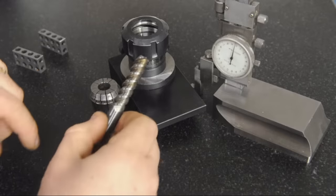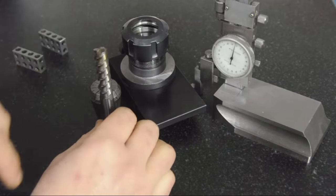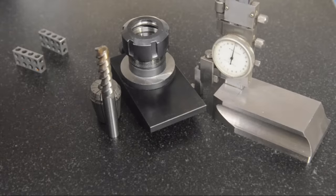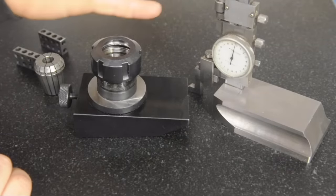Getting the end mill properly oriented with respect to the fixture, I've always found to be really the trickiest part. Not really tricky, I mean it's not difficult, but I found that if I get this right, then the grinding seems to go a lot better. The fixture goes in the grinder along sort of its long axis, right? So the wheel's up here.